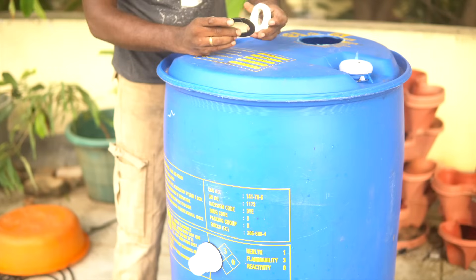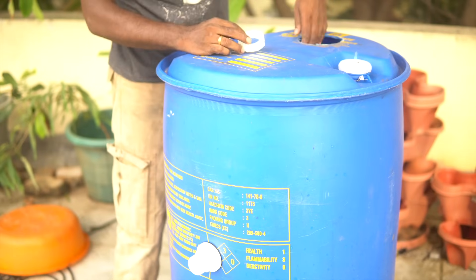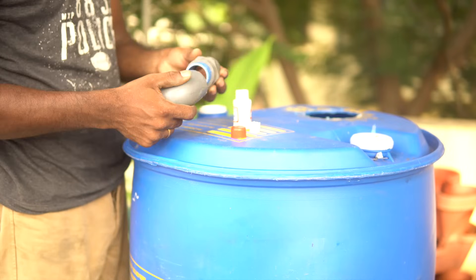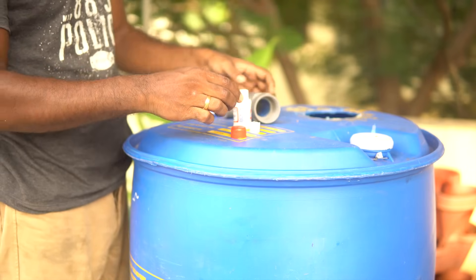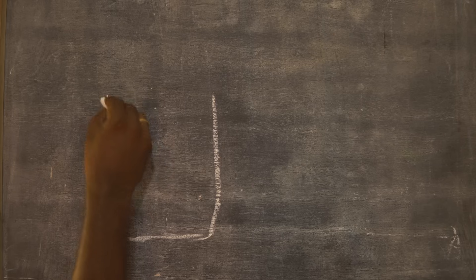The reason we fit the PVC pipe last is that it's the only opening allowing us to reach inside the barrel. I thread the other end of the pipe nipple from the inside, then add a ball valve with a suitable fitting. I make an L-joint, which is fitted on the other end of the tank nipple from inside the barrel. It was fortunate that the hole for the overflow pipe was just within hand's reach — keep this in mind when working with any barrel.